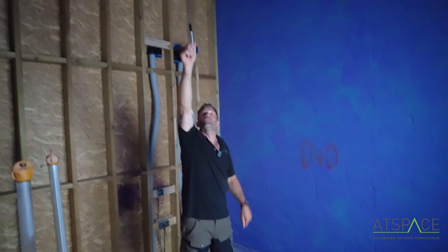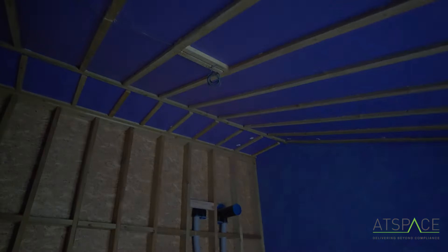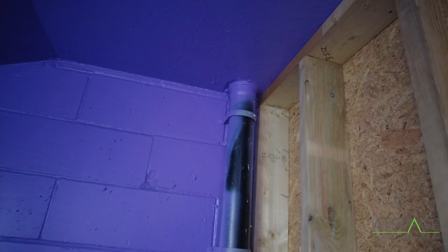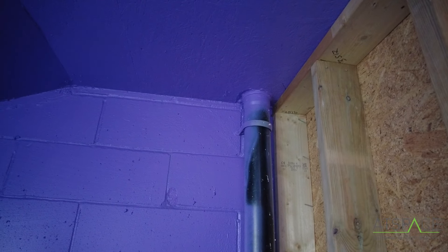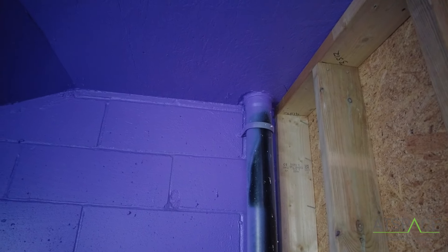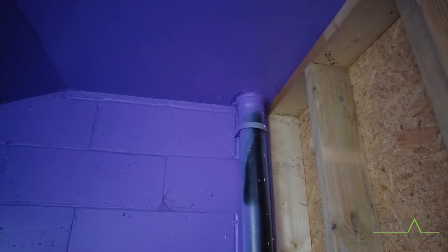You can also see where we've got the cable coming through for the light in here. Another little tip - we've obviously got soil pipes and that's a weak point. Before the spray foam got put in between the rafters, we actually put a length of soil pipe and left the actual end hanging out on the wall. Then we put the sterling board around it and sealed up the sterling board. So above it you've got a full seal of closed-cell expandable foam, then the OSB board, and then the actual passive purple. That seals it completely airtight, so there's no leakage through these whatsoever.